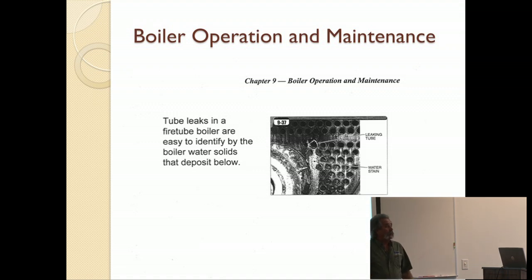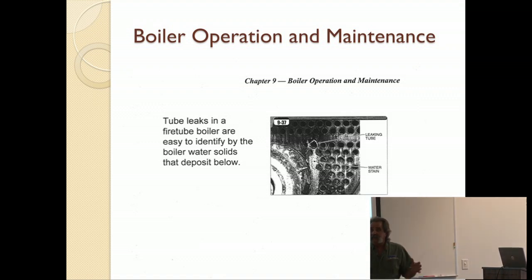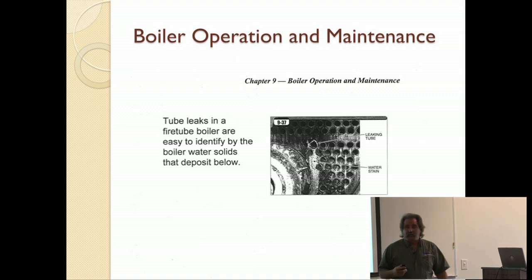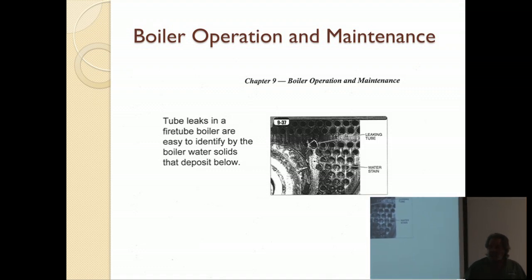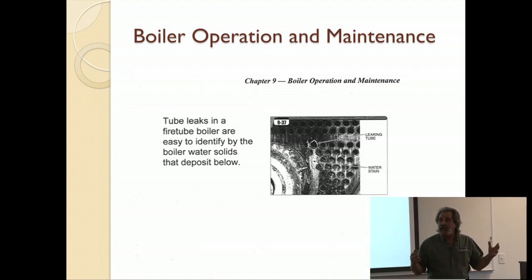When you go to start a boiler up like we have this last couple of weeks or month, when the weather started getting cold, do you notice that there's a whole lot of condensate on the floor all of a sudden? There's water, seems like everywhere, and you wonder, are my tubes leaking? They possibly could be leaking, but the most probable reason for that is the boiler is sweating on the inside. And why it's sweating is because we're putting this extremely hot gas, this heat from the combustion, going in and meeting this very cold metal.